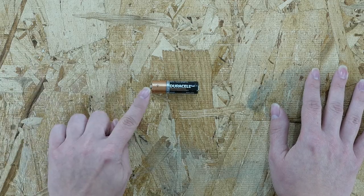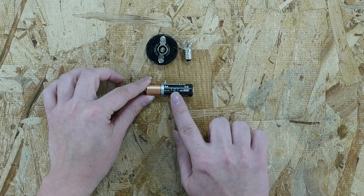For this project, we'll use a battery as the power source. Batteries have a positive and a negative terminal. Some components only work in one direction, so it's important to note which orientation your battery is being hooked up. This battery supplies 1.5 volts of power. When choosing our light, we want to make sure that we choose one that is rated for low voltage. If the light is rated for 2 to 3 volts, it should still work with one battery.